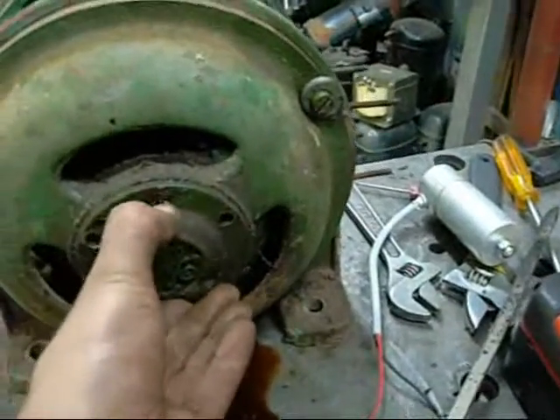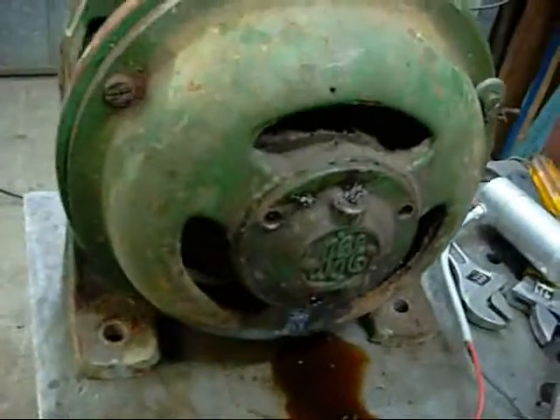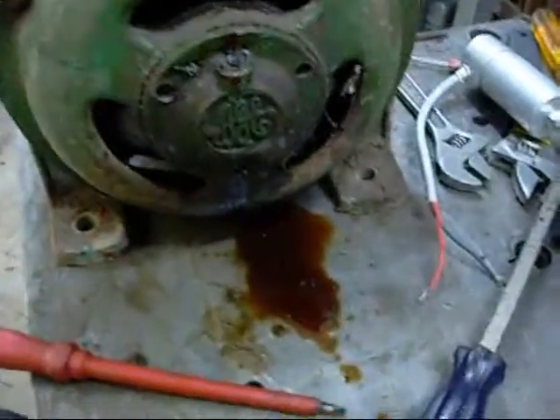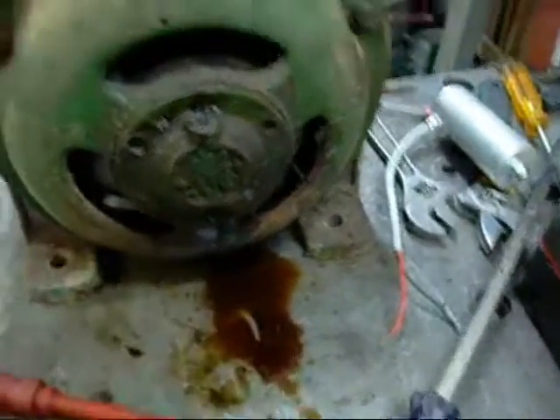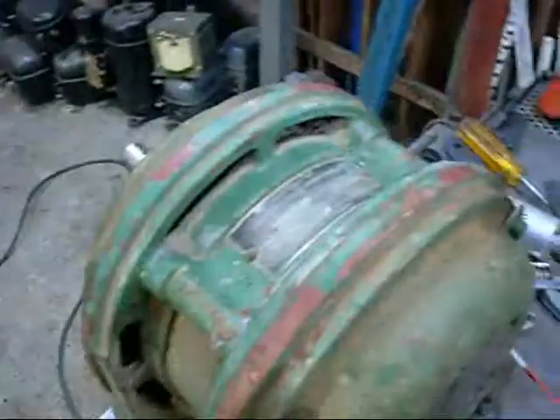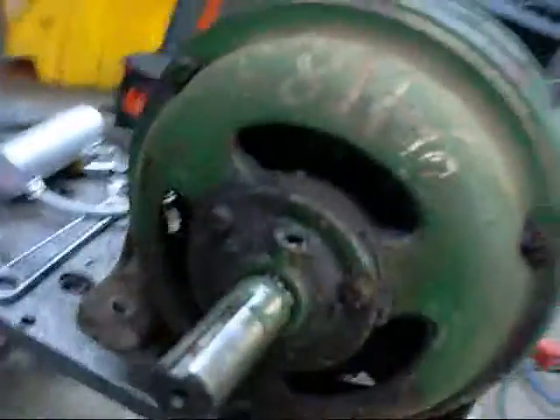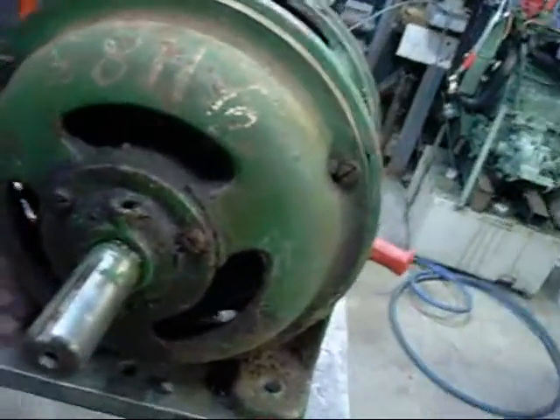Just had the bearing cap off and well there's plenty of grease in there, but nobody's ever bothered to pack it again after it left the factory. So I had to pump it full of WD-40 and try and free it up. I don't know if the windings are alright — it might have frozen up and burnt out. I've ohmed them and they seem okay but something funny there.